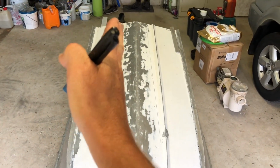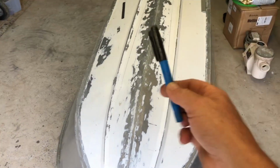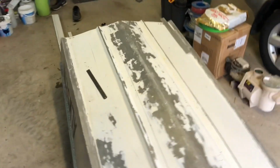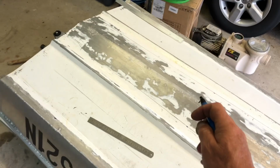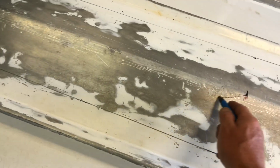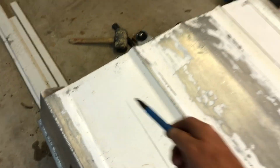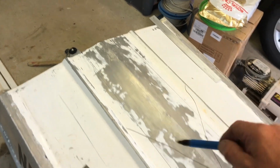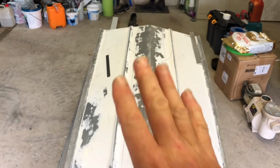There's something which is still not ideal. You can see now I've marked those lines, they angle their plane in towards the keel at the back. Normally a lifting strake is taller at the front and a little bit shallower at the back to alleviate that. I don't think that's going to affect me because I'm feeling like the boat is going to basically be touching the water from there onwards, and then the water will sit like that. So it's only the very back part of my hull I'm hoping to be on the water. I'm actually hoping these aren't in the water at all anymore and it sits on sort of a pad here. So that's the area there. I don't think that the strakes pulling in like that are going to affect it too much, hopefully. Anyway, I'm going to give it a go.